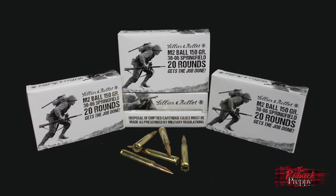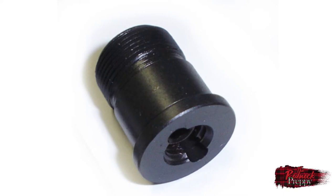At the end of the day, if you are still nervous about firing anything other than M2 ball or ammunition that replicates it, you can stick with it and no one is going to laugh at you. That said, if you don't reload, commercial ammunition made for the Garand is expensive. If you want to expand your ammo options, you can look at that aftermarket adjustable gas plug for your rifle that allows you to fire basically any ammunition — a solution that answers those who believe gas port pressure is the most important variable. Regardless of what you do: keep your ammunition at or below the CMP guidelines for pressure and bullet weight, make sure the spring for your op rod is up to spec — that's really important — and make sure your rifle is properly greased and lubricated. Do these things and I wager you're going to be alright.